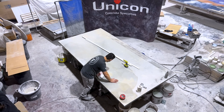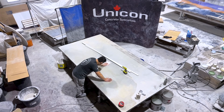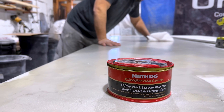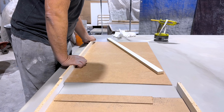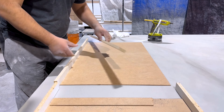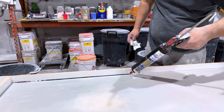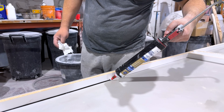Step two: building the form. There's actually quite a bit to this, and there are different ways of going about it, but here's how Simon does his. He's got a specialty pouring table that's completely level — a great place to start. You can use car wax to prepare the surface for a release, use MDF cut as a border perimeter, use double-sided construction tape to adhere it to your table, and use silicone in all the corners of your mould so you get a rounded corner for your countertop.